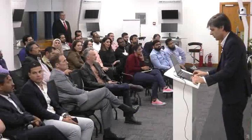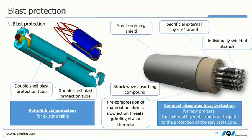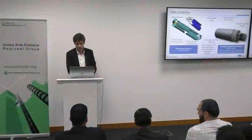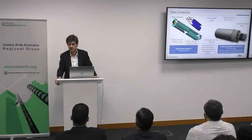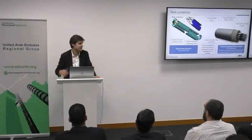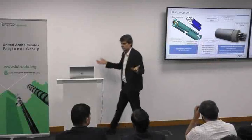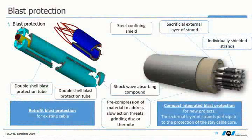This is an example of a bridge using both fire protection and blast protection. For blast protection, VSL is developing a solution capitalizing on the fact that a stay cable under permanent service is stressed to 50% of GUTS, meaning 50% of the cable capacity is redundant for safety. The idea is to use those additional outer strands to protect the core strands inside in case of blast, by having equal protection for each strand — the outer strands deflect the blast load and protect the core, making the blast protection extremely compact and lighter.